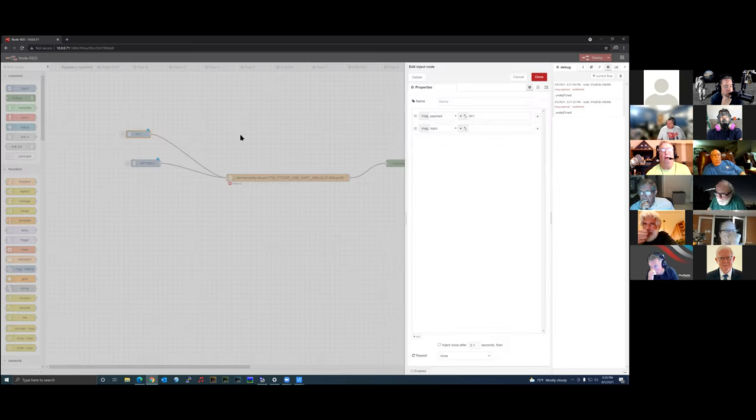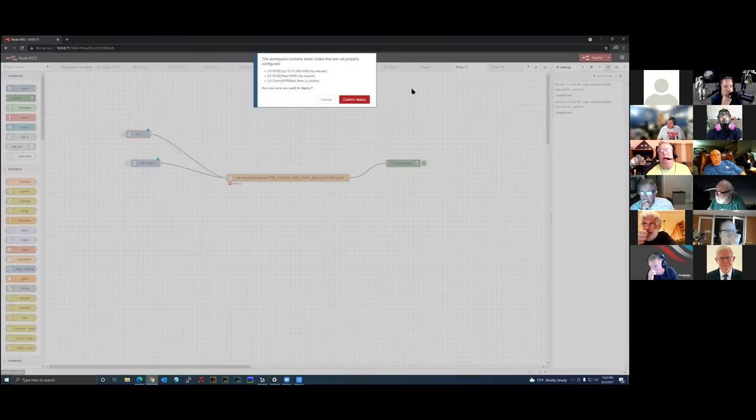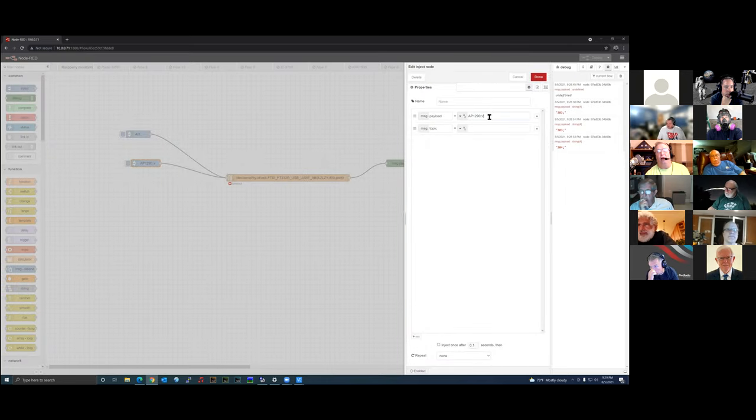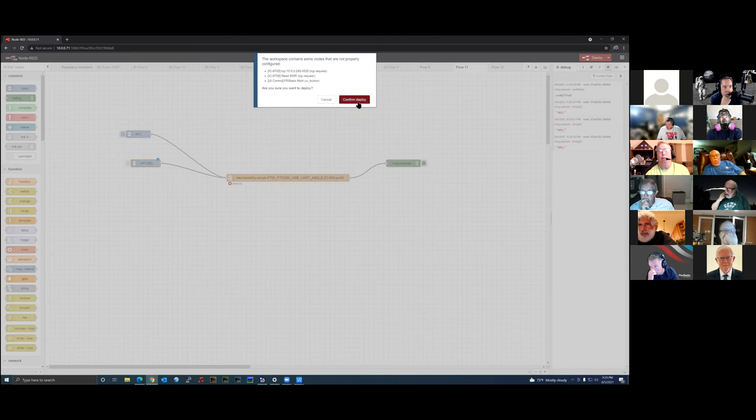Yeah, try it without the carriage return. All right. Because I think when you send it, it sends a carriage return. Yep. So it's injecting it, and there you go. AI1 semicolon interrogates my beam heading right now. Now, if I take the carriage return out of here, it's AP1, and then the beam heading semicolon, and every time you change it, you've got to deploy.